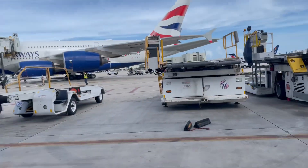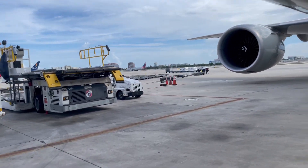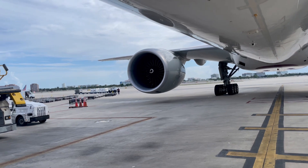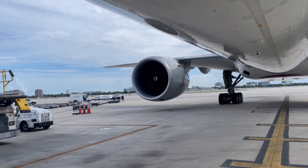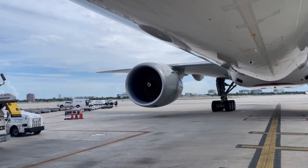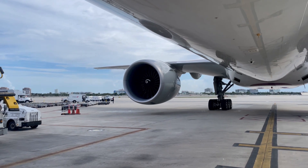We keep the engine running. Hello, cockpit! Good afternoon. Are you ready to disconnect the right-hand IDG? Yes, it is running. The only thing you have to do is just lift the guard and push the button, and then the drive light should go on. Lift the guard and push the button.